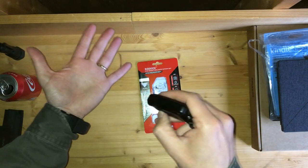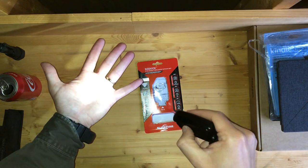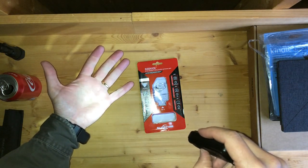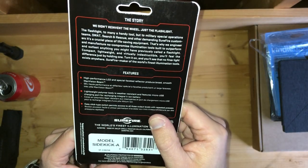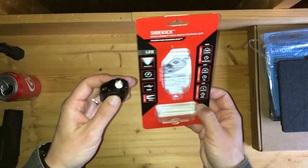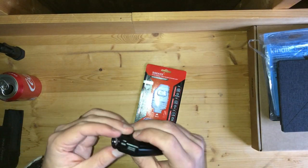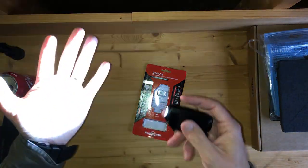The way it works: press once for low, again for medium, again for high, and it cycles back. If you turn it off and wait a few seconds, when you turn it back on you get back to low. I believe you can also reverse the programming — hold the button and make it go high-medium-low instead of low-medium-high. For an EDC light I prefer low first, because you'll use less battery power than if you come on at high first. For a light not meant for life-saving self-defense, I'd always prefer low then medium then high.